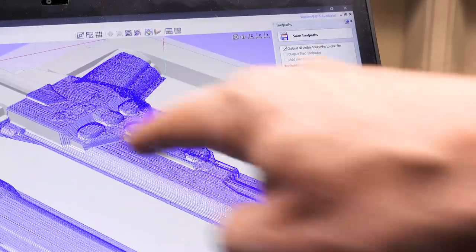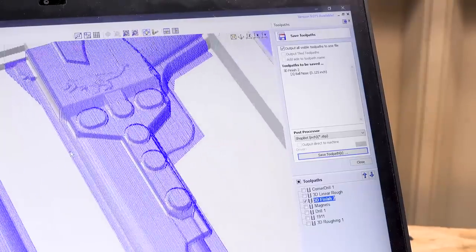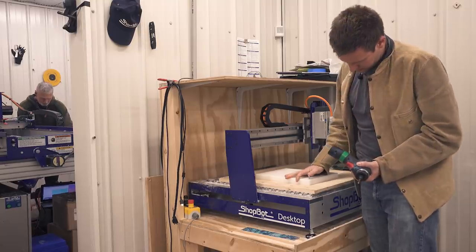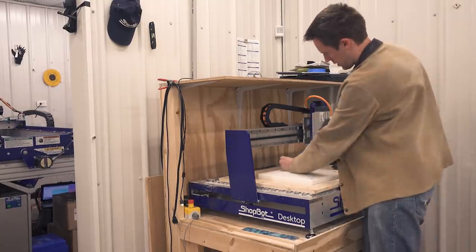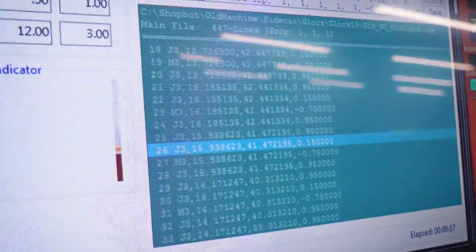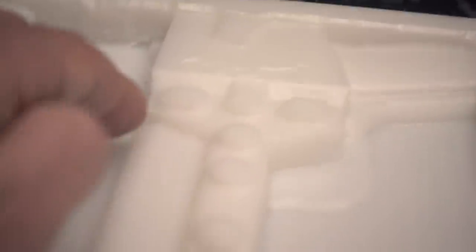Our finishing path has lots of really close lines for that smoothing bit, but only in the places where the model really needs to be smoothed out. We take our block of HDPE and stick it on the little prototyping machine. Here is the finished mold — you can see the smoothed areas. This ball nose cutter is able to cut on all angles to give us pretty good curves. And if I set the step-over — the distance between each pass — to be even smaller, we get even smoother results. But this will be perfect for the holster we're hoping to create.